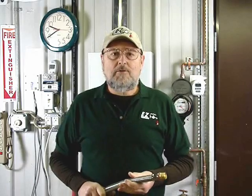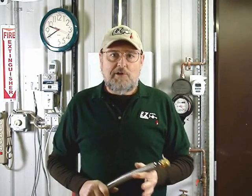We've had several instances where people call us and say it won't fire up. And when we ask them to turn off the cold side of their heater — the intake water side — turn off the water and take loose the exit hot water side, the pressure is pouring out while they've pressurized their hot system somewhere else. And almost always, it's that error that I speak of. These are our primary problems that we deal with in our technical department with people who are installing a tankless heater.